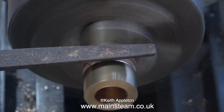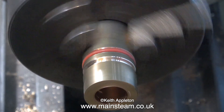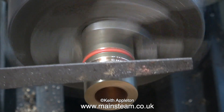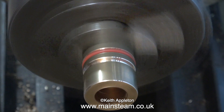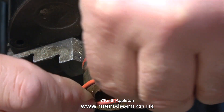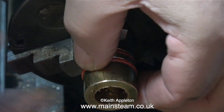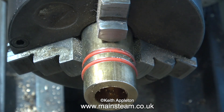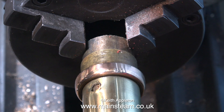In this clip you can see that I've fitted the first O-ring somewhat prematurely. Now I've machined the other groove, I'm removing the sharp edges from that. Once again I'm using the file to remove more sharp edges on the piece of metal, and here I'm fitting the second O-ring. If this was a piston I wouldn't do it this way — I would clean up the part before fitting the O-ring — but this is a very simple part that's just going to fit inside the chimney. And as you can see, the chimney is a good fit.